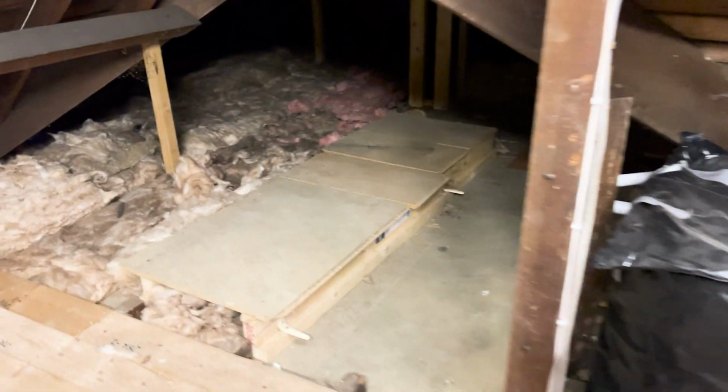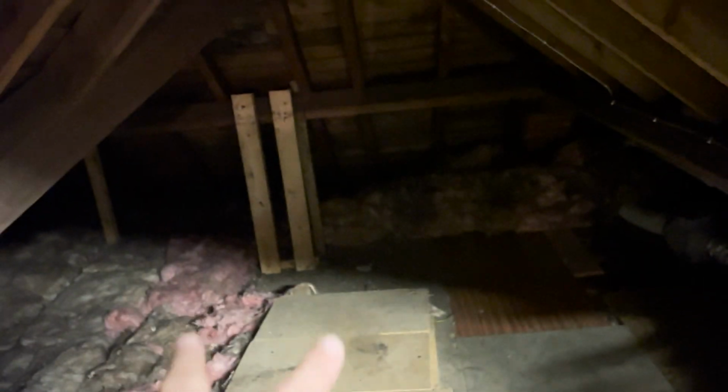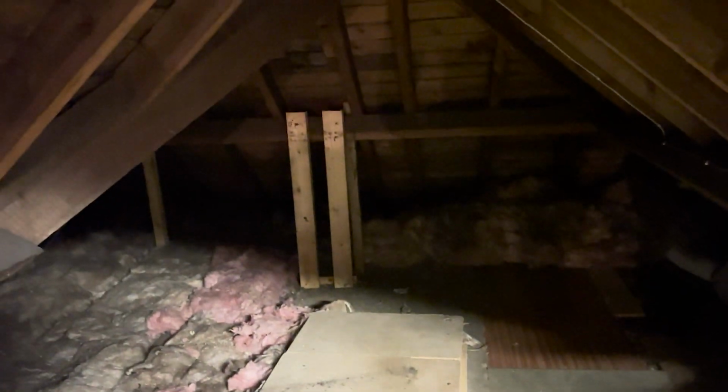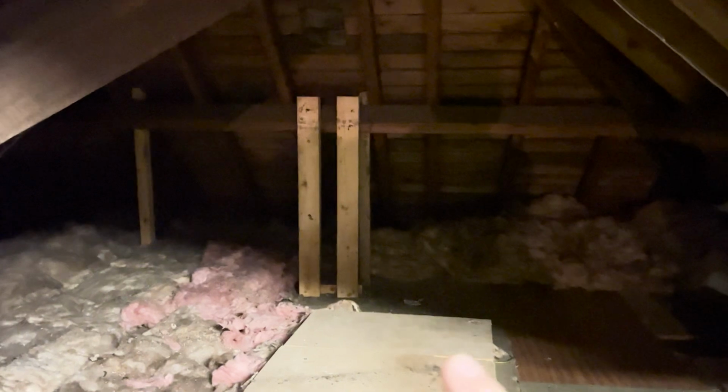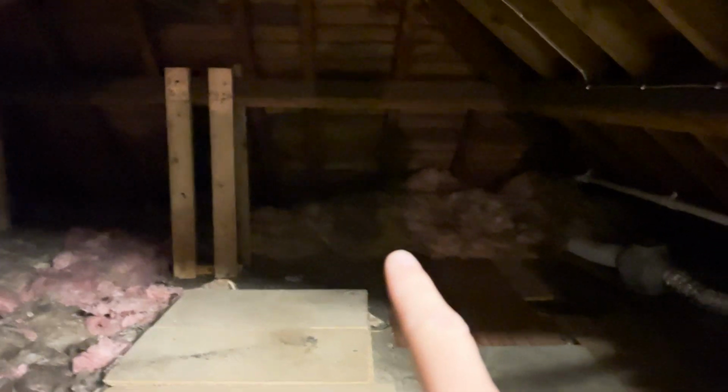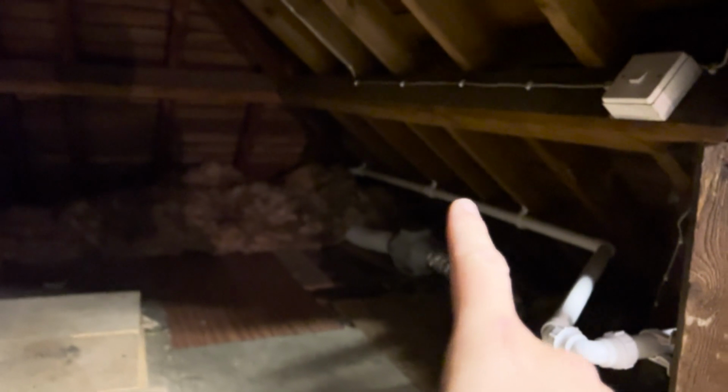Now under here, on those two battens, was the old boiler, and I'm not joking when I tell you the bracket was screwed up in two holes on 25mm screws. Promise you. That's where the vertical flue went through. The condense that went out for this boiler went across there and down the eaves, as you saw earlier. I picked up on that and used the 1.25 inch and brought that round, and that's my overflow in the tank. It's all clipped, goes out the eaves and down there. So that was nice.